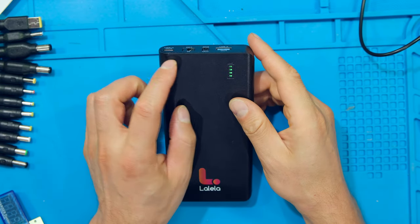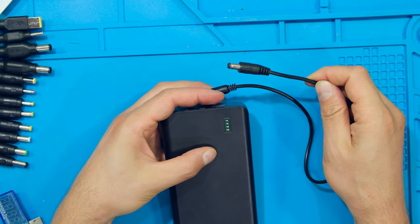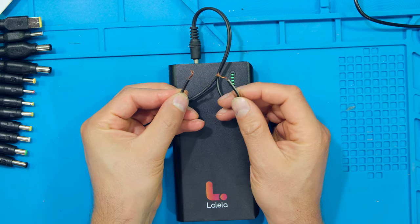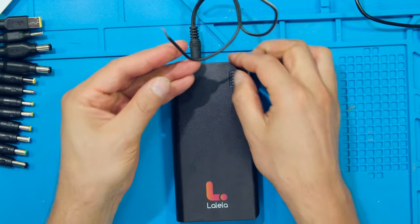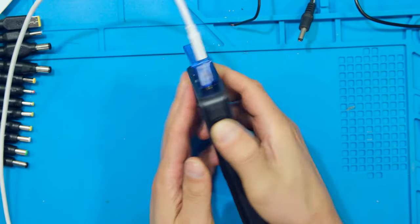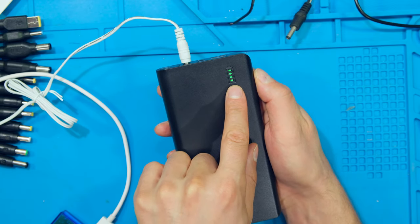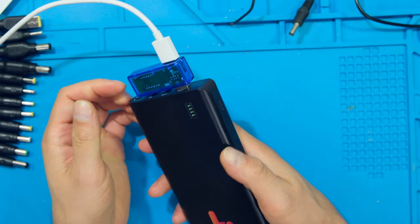The final test is to see what happens if a dead short is applied to one of the output terminals — as could happen if a cable were cut by mistake or a laptop had a short circuit on its input. I'm going to apply a short circuit using that connector. There will be a spark because this is rated up to 3 amps. There was the spark. Notice the unit is off — trying to connect USB on the side and powering it on does nothing; it's completely offline. However, to get the unit back to normal I have to insert the AC adapter charging cable, and once I do that I can reset the device. Plugging in my cell phone — we're back in business. The device has over-current protection, which is great.